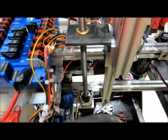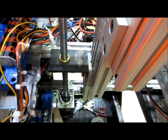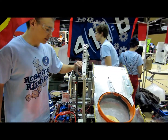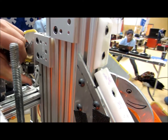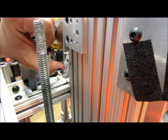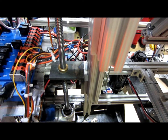We have another limit switch on the very top — right there. We also have another limit switch here. So if I wanted to stop this going up, it's here. This black bar is what's designed to hit the limit switch to stop it.